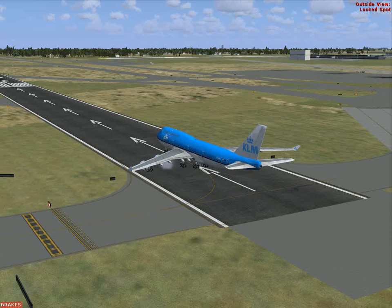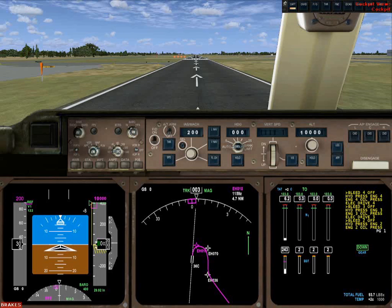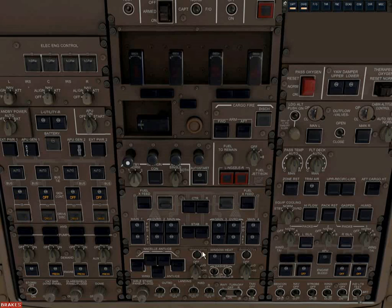There's light off — number one just fired up. The startup is essentially automatic: once it reaches a certain speed it will turn on the fuel and the ignition, and we will have light off. Once everything is stabilized, the start button will pop back in. Once the engine spools up and the interstage pressure is stabilized, the engine bleed valve will reopen, indicating that that engine is now supplying the bleed air bus with air. The hydraulic pumps kicked on, the generator kicked on, and the APU generator is turned off.